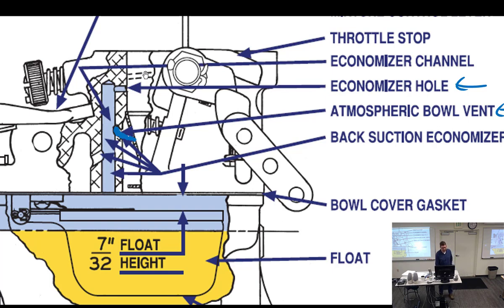Okay, I'm gonna tell you what my memory is. I haven't looked at this carburetor in a year. I'm pretty positive they've drawn this a little bit backwards. As the throttle starts opening, it lines up at a certain point somewhere around here, and the alignment of the throttle valve creates a low pressure in this area, because I can create a Venturi out of anything. So yeah, I think the drawing is a little crooked. It probably tips down a little bit, so it'd be opening down. This one tilts down, it doesn't go up.